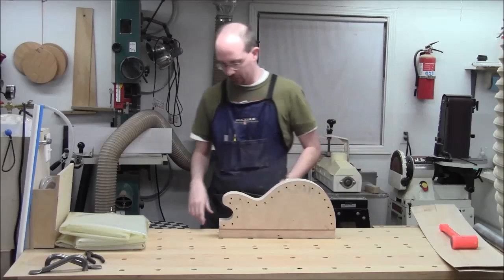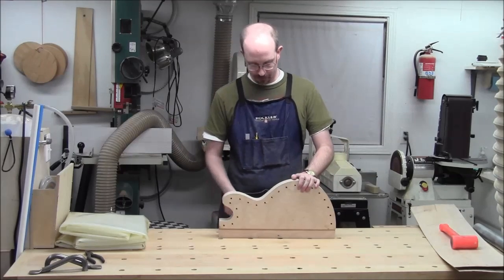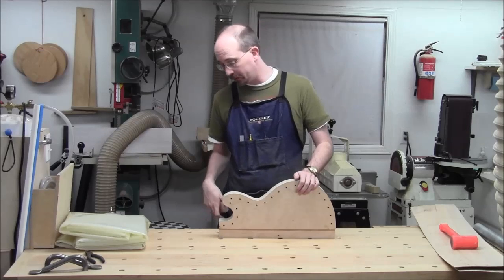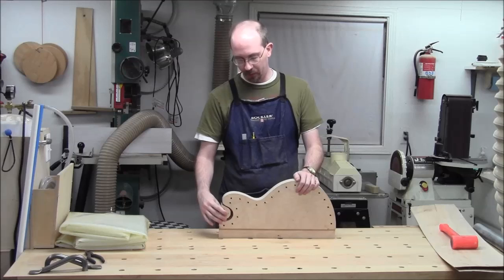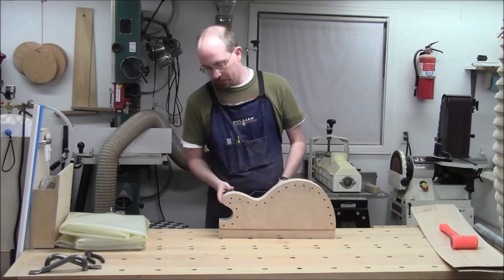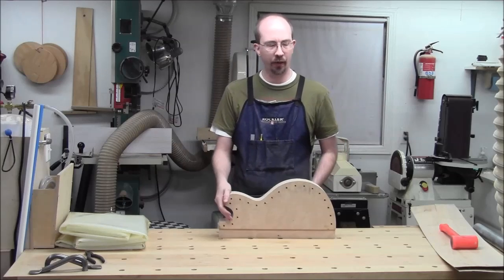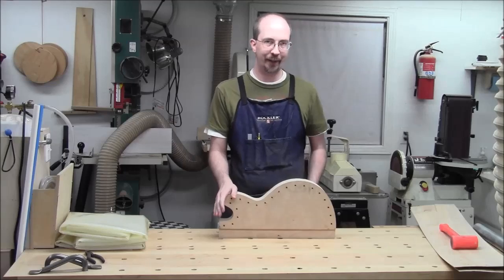This will be the bending form. The one thing I'm a little concerned about is being able to bend this cold. I had thought about doing it cold. I don't think I can do it cold. So I've got this little notch here to pull the thing in on the ears. But this is a pretty heavy radius, and I think cold is going to be Splitsville.